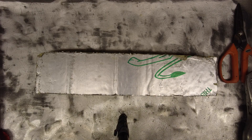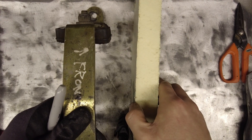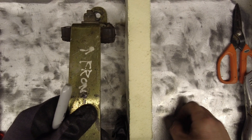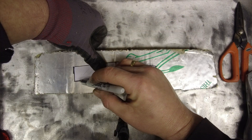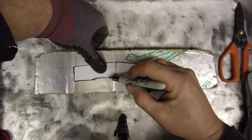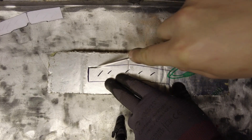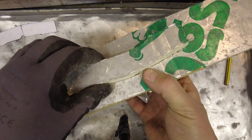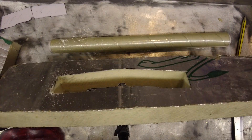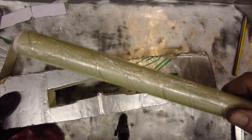I don't really know what most people would use to cast a bush like this for the gearbox, whether they do it in sand or some other products, but I don't have any of those things so I'm just using what I've got in the garage. For today we're using a piece of insulation - just standard foam insulation. It's 35mm thick and it's just a fraction thinner than the inch and a half strap, so it should be just about bang on. Before I can fill the mold I need to seal the bottom of it, so I'm going to do that with just duct tape and cling film - kitchen cling film, or sandwich wrap, whatever you guys call it.